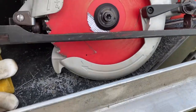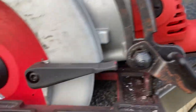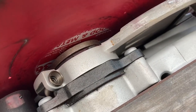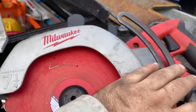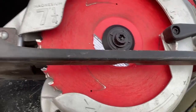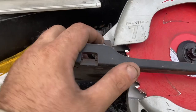Better than a metal cutting saw, and I'm using it. It's plugged in to the SA200. It does run on DC because that's just a 9-inch angle grinder motor in there. The blade I'm using, this is the wood and metal, kind of burnt out, but it's the wood and metal blade from Diablo. And I find the wood and metal combination one cuts aluminum just as well as it does steel.